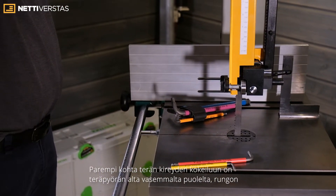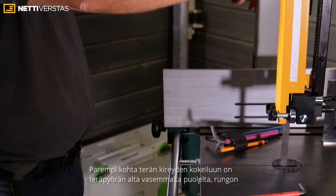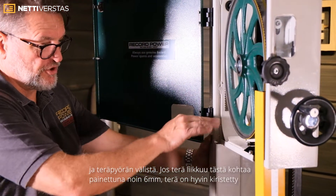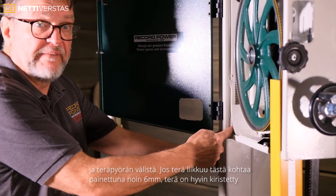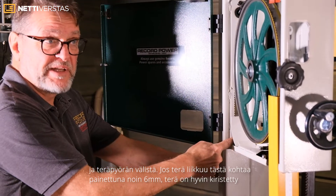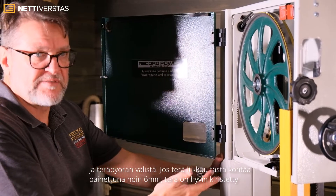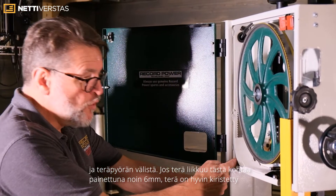The best thing to do is take the center of the wheel and come to the bottom of the wheel itself, then come across. You want to feel the tension at the bottom — across from the bottom wheel — and what you want is about a quarter inch or six millimeters of movement from center.